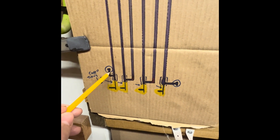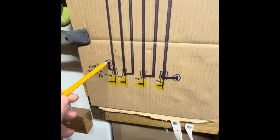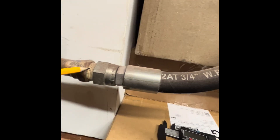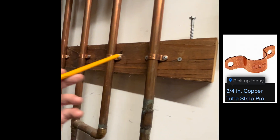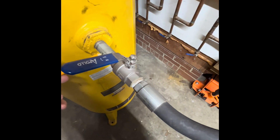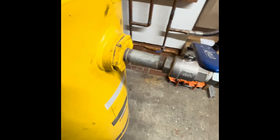On one end you solder on the bushing; on the other end it threads into your hydraulic hose. Same thing on the outgoing side — solder right in and you have the threaded end there. This coupling here was a mistake I made; all you need is a straight piece of pipe. You'll also need about 12 copper three-quarter inch wall brackets to mount to the wall or two-by-fours. Coming out of the compressor is just a three-quarter inch ball valve — threaded on both sides with a piece of galvanized pipe, also three-quarter inch.